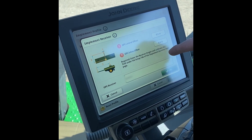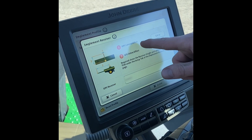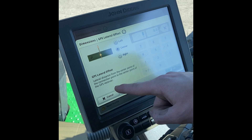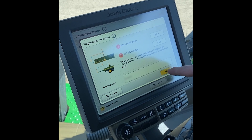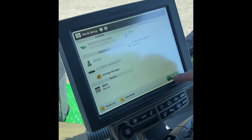These can vary depending on what make and model you have. Be sure to measure these out to the best of your ability. Lateral will be left to right of center as shown on screen. Inline will be from the hitch to the actual location of the GPS. Once you have these filled out, hit OK and save, and now you're good to go with your implement guidance.